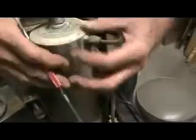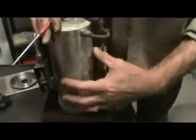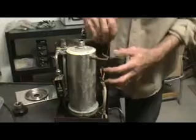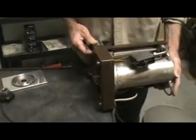So there's a lot of electrical diagnosis to do down the line, but it's kind of like reading tea leaves. You look and you see, well, what happened to this machine? And it does interest me to see that first we have the leaks. It gets wet. This happens over a long period of time to produce this much scale. It gets wet inside, stays humid. And once it stays humid, then it creates the atmosphere for these to all oxidize. These oxidize and melt. And it's just kind of a wonder that the machine didn't completely short out.